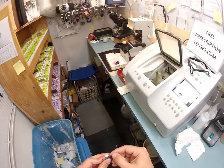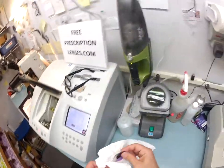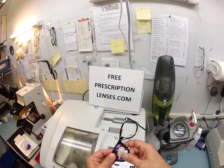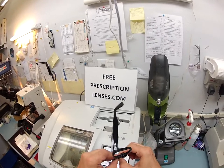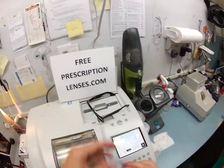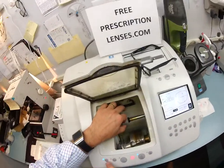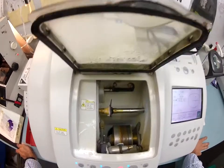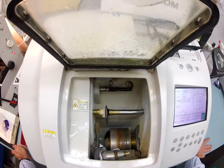Back to the hand stone, back to the safety bevel, scraping everything off the edge of the lens - I'll just do it right on the floor this time. I'm going to pop your lenses into the frame: tuck them in at the outside corner closest to me using my thumbs, press down at the center. Not yet - another tenth of a millimeter is going to come off. Hit retouch. The golden rule: you can always cut more off a lens, you can never add it back on. So I start a little large and work my way down.